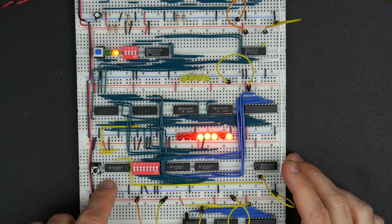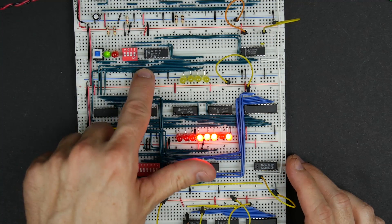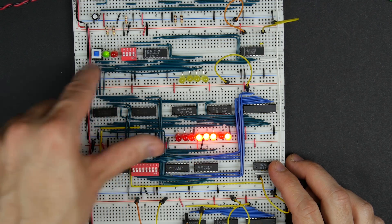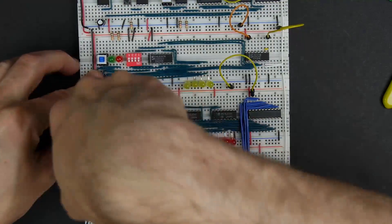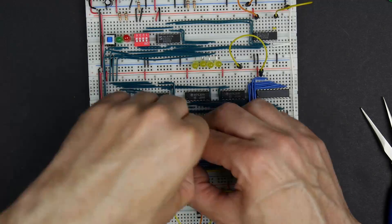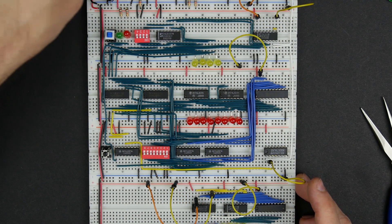We're not actually selecting correctly because I neglected to connect the select pins. The 74LS157s need their select pins connected — pin 1 is the select pin, and up here it's connected to the red LED which goes low when we go into write mode. We need to bring that signal down here so all four 74LS157s are selected together. That ties all the selects for all four 74LS157 chips to the same switch. I think that should be almost everything for the RAM module, so in the next video we'll power it up and test things out more thoroughly.